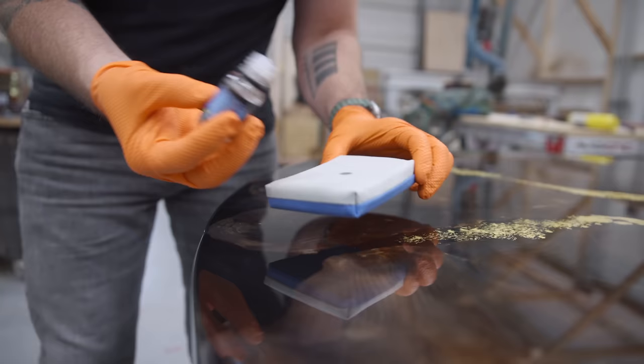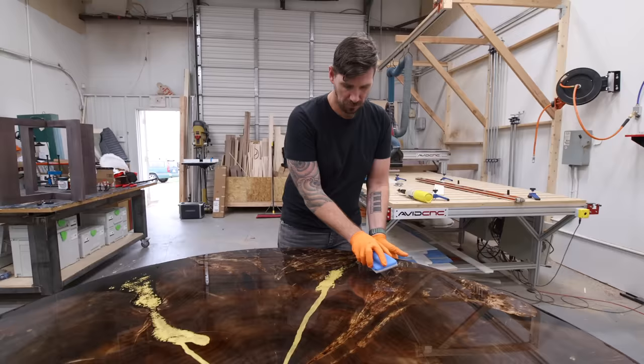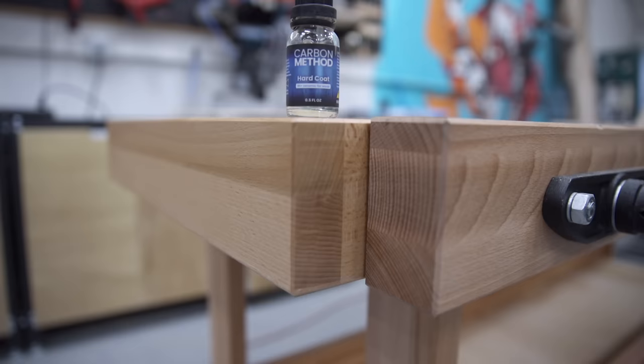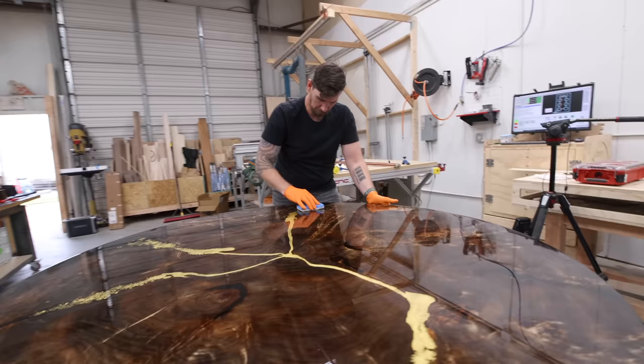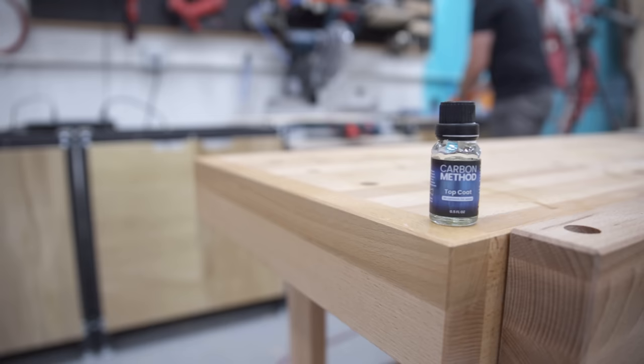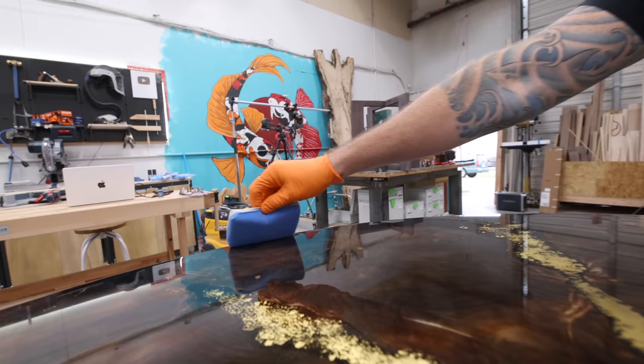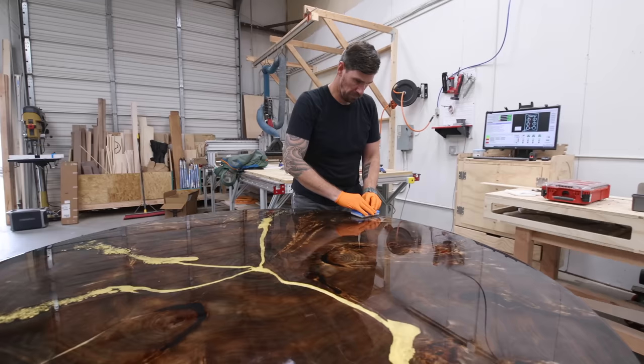I had such a good finish with the Total Boat tabletop epoxy that I didn't need to sand and polish it. I did, however, add some Carbon Method nano finish. Epoxy finishes look great but without extra protection they can get scratched up. With the Carbon Method I'm adding two layers of nano ceramic finish to protect the epoxy and add more sheen. The first coat is 9H hardness, providing the main protection. The second coat is 7H hardness and more flexible — so the first coat protects the table and the second coat protects the first coat. Given this is the table I'm selling, I need to make sure it's protected for daily use and will look good for a long time.